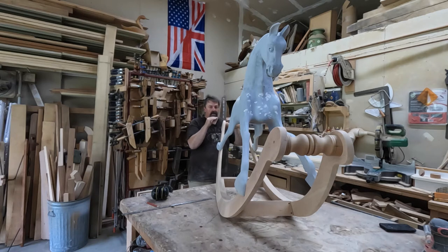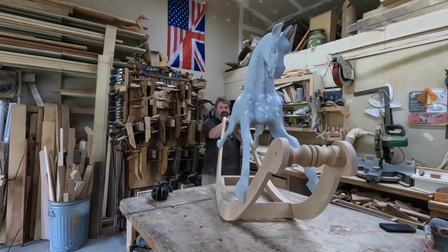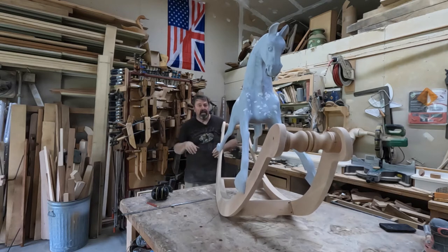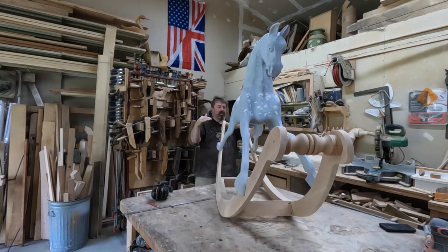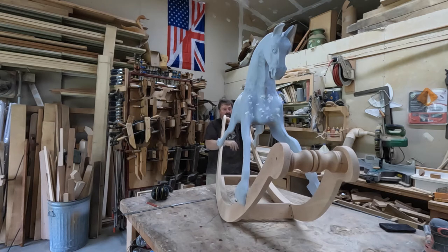And one of the ways you can tell if you've got a really good set of bow rockers or the person knew what they were doing is if your ends down here match up as far as being level with the front. And again, I always look down and I always try to make sure that that is all perfectly even down there. And when you look down it in Anthony Dew's book, The Rocking Horse Maker, you'll see in there that he's got sticks kind of coming across. I believe they're winding sticks. He calls them winding sticks, but you'll see them laying across. And what he's doing is he's lining up basically your horizon or your two lines and making sure that they are nice and parallel to each other. And again, these ones are really, really close.